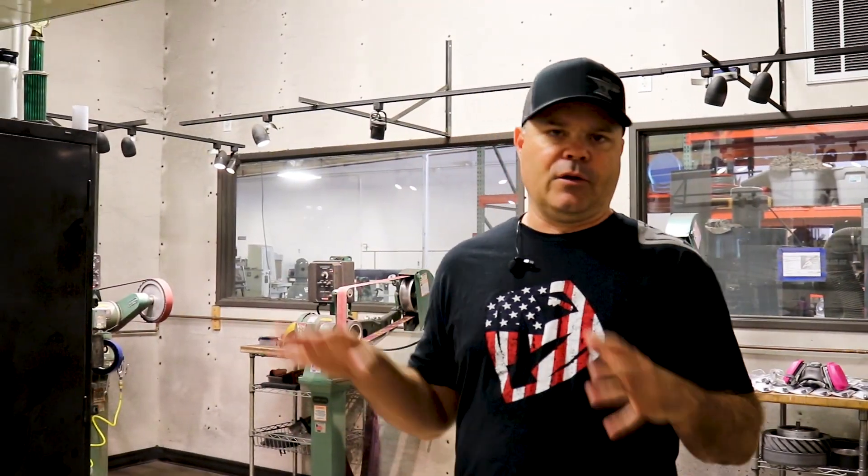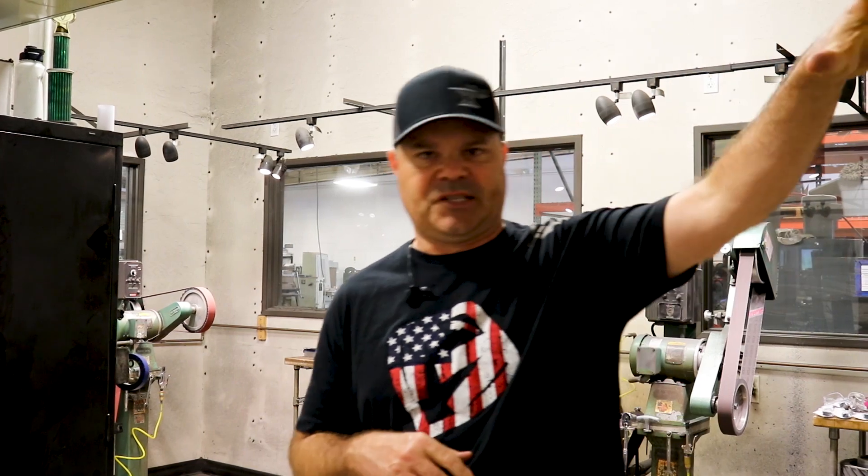There is a tendency for people to see our technology and machinery and say Greg's knives are CNC made, and it's mostly a mid-tech. It's not really a mid-tech. A mid-tech is where you have your blades ground by some shop, your screws made by another shop, your handles made by probably another shop, and then they send them all to you and you cobble them together, dealing with the tolerances and plus-minus variants, and then maybe you put your name on it. Another kind of mid-tech is where it's all been assembled by another shop, sent to the maker, and maybe he edges it and puts a signature on it. That's a mid-tech.